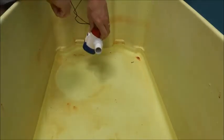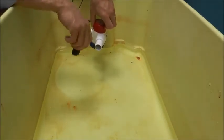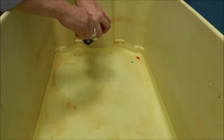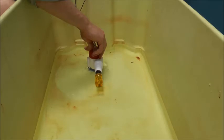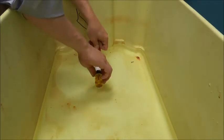What we have here is the new next generation Rule bilge pump. I've got that same simple plug — let's plug up that discharge. You notice when the pump first turns on, you can hear a chug. That means that the water is already in contact with the impeller. Right now it's just cavitating. As soon as I pull this off, that water is going to come shooting out.